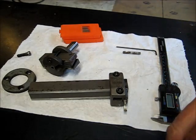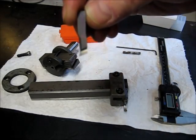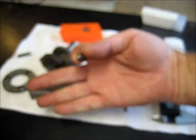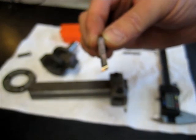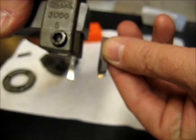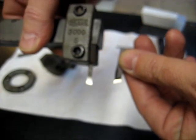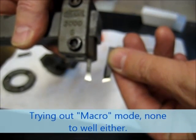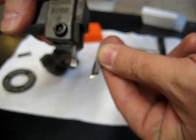And let me get out a different style cutter. This cutter here is designed to cut, you see the difference here. The low point of the angle is designed to cut a clean disc and leave the tapered side on the exterior. So this cutter here cuts a clean hole. This cutter here cuts a clean disc.